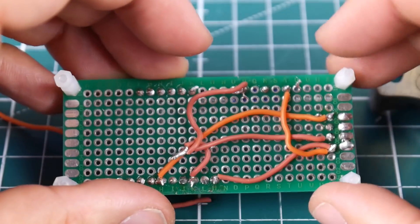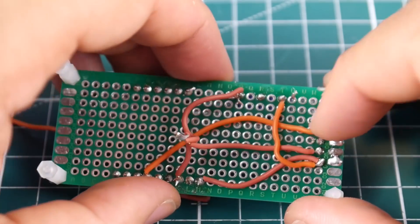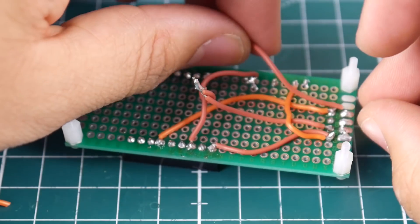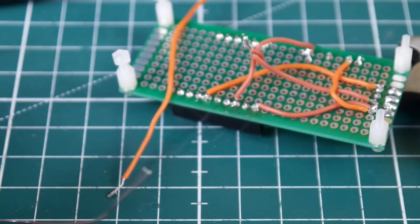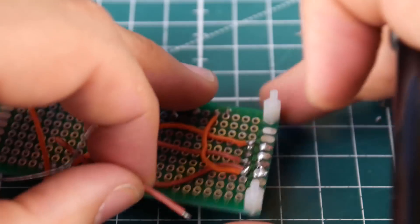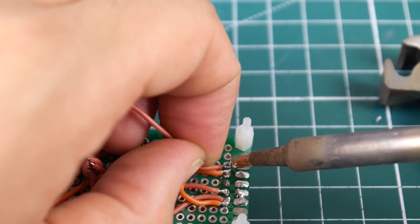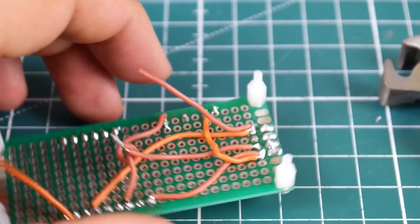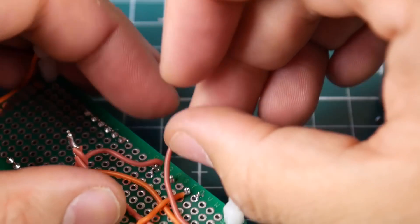Now we need video, which is going to be on AUV2 — which is that one right there. As you can see, that's video, which is going to be the video of the module. We're going to place the video wire right there in the middle. Let's see if this will reach — yeah, that'll reach just fine. Let's add some solder, and we're going to start on that last one right there, which is AUV2. Just want to keep pressure on both wires so we don't pop the other one off. There we go, perfect. Now that's going to go to the middle pin right there — we should be good to go.